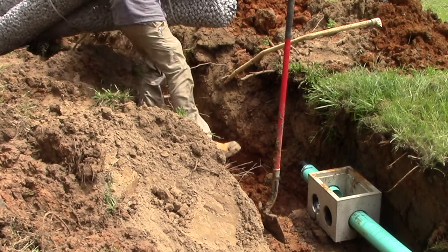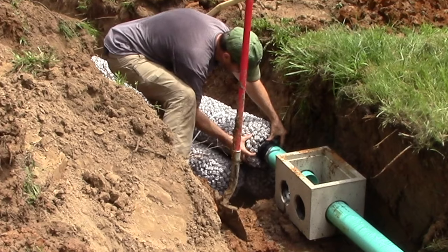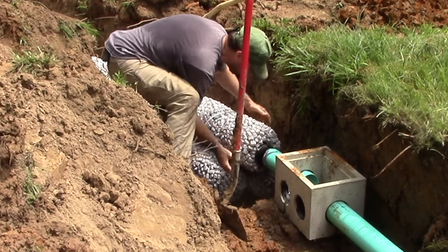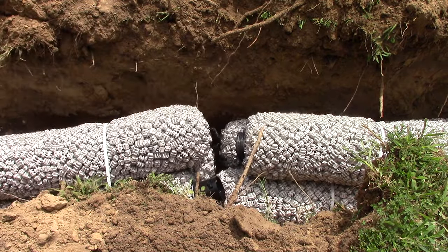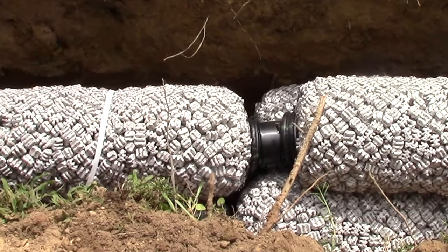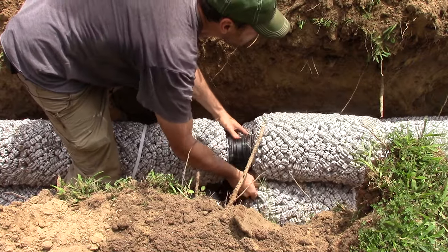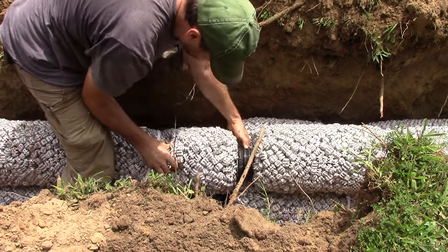Now we get our first drain tile in our trench. The trench is about three feet deep. The nice thing about these is you can bend your field if you need to. We're going to put this coupler right in the end of our first pod. This is so easy to do — anybody can really do this. Right down in the hole, we put the two large bottom pods on the bottom and then connect the four-inch corrugated pipe on top into the last piece. Sometimes you've got to push these other ones out of the way so the coupler can get in far enough — there we go, perfect.